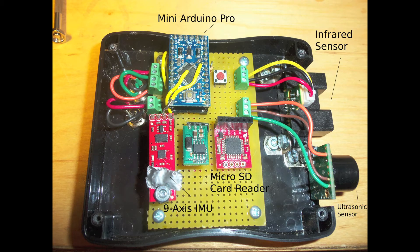And here's what's inside the black box. There's an Arduino microcontroller that samples the sensors and transmits the values to the microSD card reader and the handlebar display. Also there's some extra space in there, so I put in the 9-axis inertial measurement unit, or IMU as they're called, which contains a 3-axis accelerometer, 3-axis magnetometer, and a 3-axis gyroscope. There are all sorts of applications I could come up with for using that, yet to come. And also there's an infrared distance sensor in there which works based on a different principle than the ultrasonic sensor, so I'll be playing with that too a little bit later.